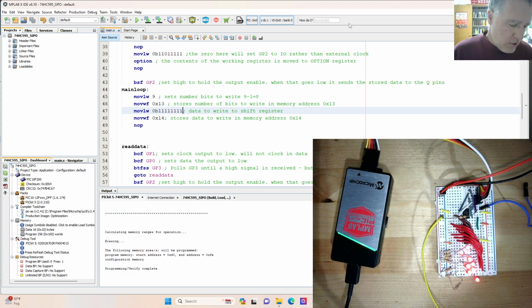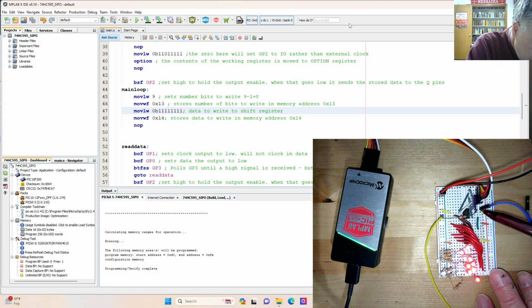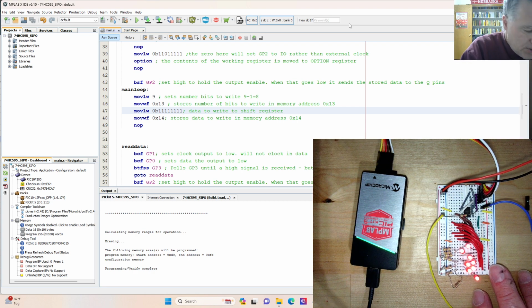All right, so looking at the circuit board here, we can see the PIC10F200. This is connected to the PICkit 5, which will help us program this. These wires, while they're important for programming the chip, wouldn't be there in the field if you had programmed this chip and were running it. What we would need though is the two yellows here showing the ground, and this is to 5 volts to power the PIC.